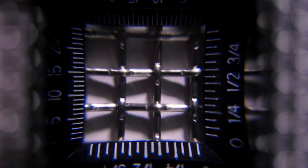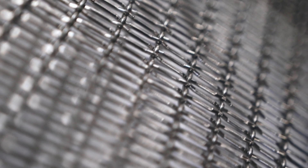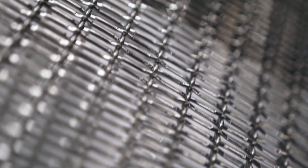Something that you can easily overlook is the aperture profile of the mesh. The three main types of aperture profiles you can expect to encounter are square, rectangular, and zero. Filter mesh is considered to have a square aperture when the warp and weft wires share an identical wire diameter. Rectangular aperture is used to classify mesh filters that use warp wires thinner than the weft wires. When the mesh places the warp and weft wires as close together as possible, it's considered to have a zero aperture, which is the world of filter cloth.